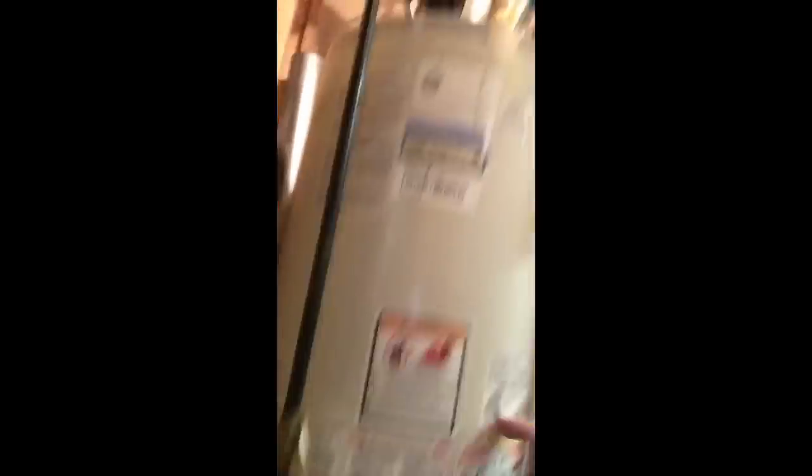If you've replaced everything else, this stuff right here is super easy to fix. All of it together costs maybe $20 and I live in Canada, so in the US maybe that's like $6 worth of stuff. These are your combustion air intakes — there's little tiny holes. The air comes in through here, goes down the side, and then there's a little hole at the bottom that feeds air into the middle of the combustion chamber, right underneath your flue. Over time that collects debris, and the way you clean that is you drain your tank, put your tank on its side, take the few screws on the bottom, pop that plate off, and just wipe it clean — it would probably look a lot like the lint screen in your dryer.